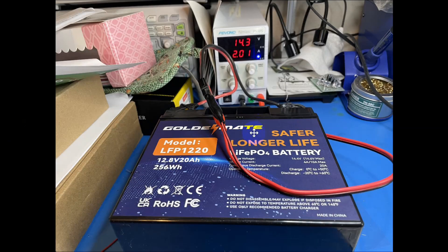This is how I charged it initially. No charger came with it, so I used a little lab power supply — I set it as high as 14.3 volts. It's putting two amps in, about 30 watts. Note the A light is on — it's current limited right now. When the current comes down a little bit, I can take it up to 14.5 or 14.6.